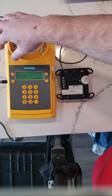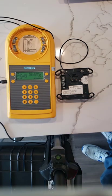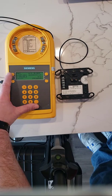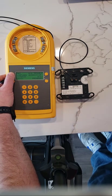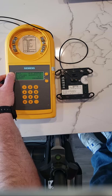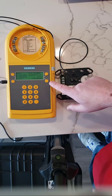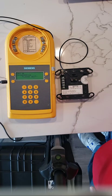For the trouble setting, there are three separate options. I'm going to choose the upper one — I can leave it as normally open, trouble status, or alarm. In our case I would like to leave it as alarm. All that's left to do is choose 'Program' and wait for a few seconds.